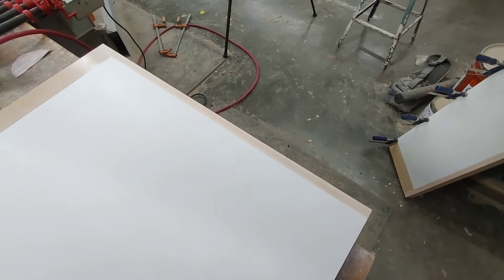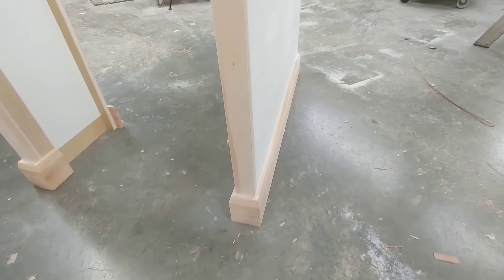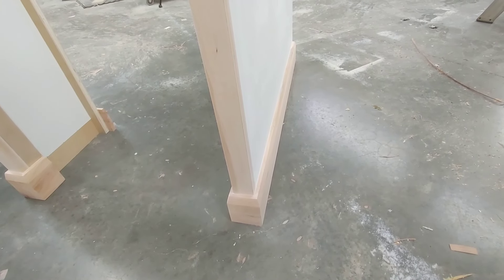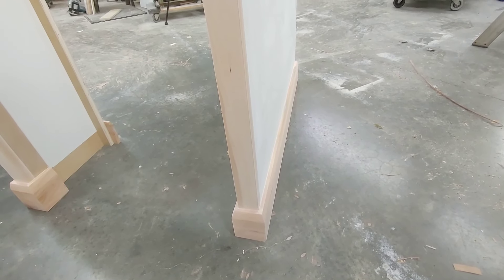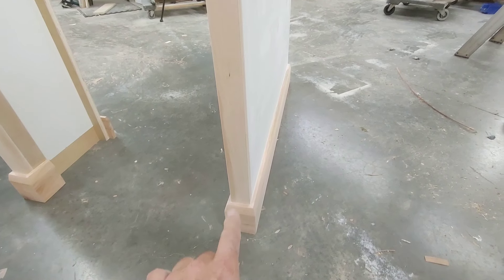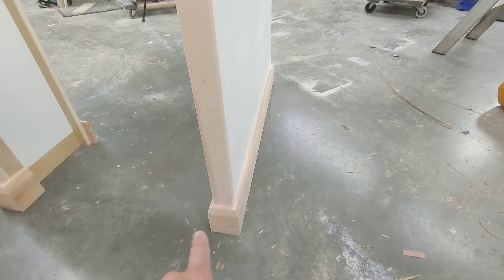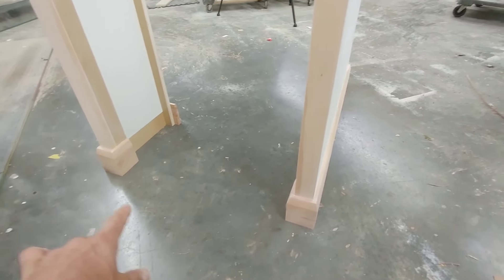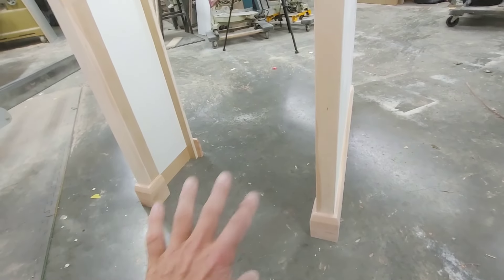This is ready to go into the booth and I'm pretty happy with the way it turned out. I got the post done — I actually glued the baseboards on the post for the island. I was originally going to make them as a slip-on molding, but it's a brand new build so the house is nice and flat and I think I can get away with it. I won't have to do any scribing on this floor. If it was an older home I'd leave the base as a slip base so I can put the post down, then lift one side, slip the base in after it's been leveled, and trim and scribe the base to fit the floor. In this case I don't have to worry about that, so I glued and nailed everything, puttied it, and I've got spackling in all the corners at the 90s for a nice crisp line.